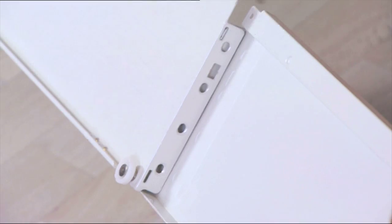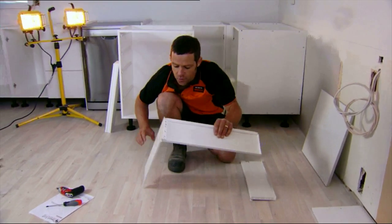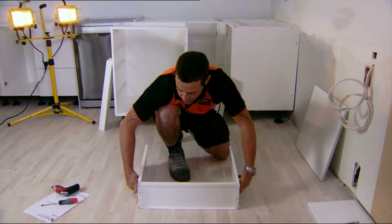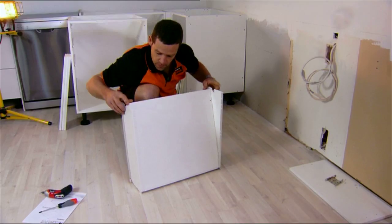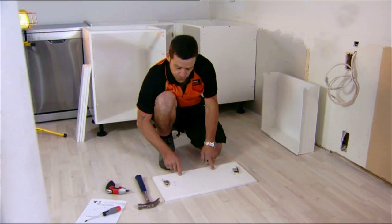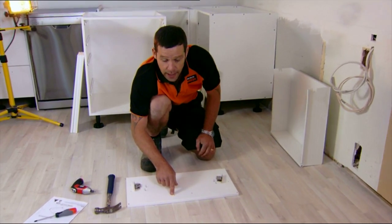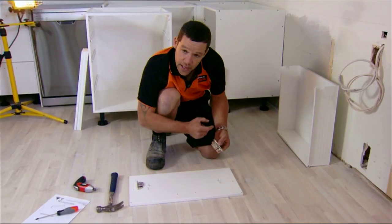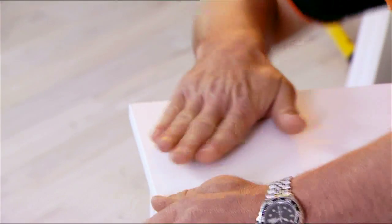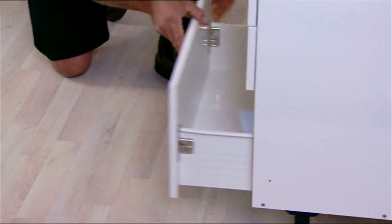Let's put our drawers together. Take our metal sides, clip those in nice and gently and swing that around — that's self-supporting. Clip the other side in and turn that upside down. The base panel has got two holes on either side — these line up with the lugs sticking up on our sides. With our drawer front, put these little rubber soft-closing lugs in. Our holes are at the top for our handle, so we know that is the top. Our little clips on the side go on the outside with screws facing out — we use these for adjustment later on. Tighten up the screw on either side, and that's the drawer unit done.